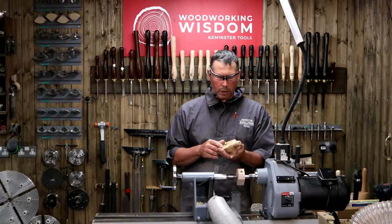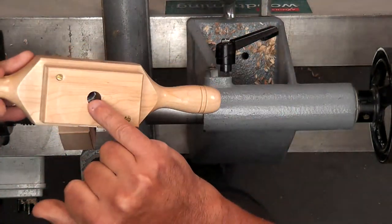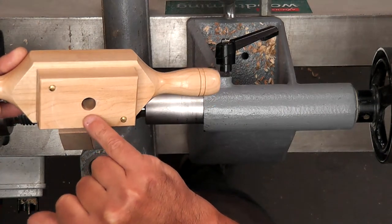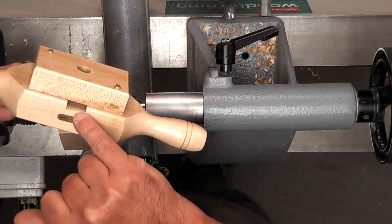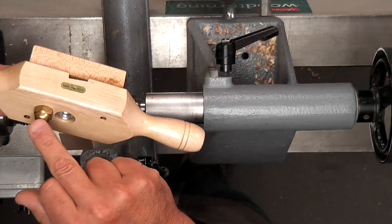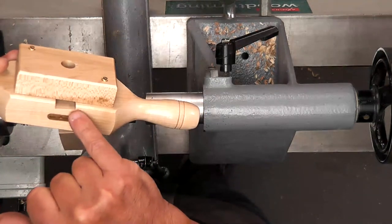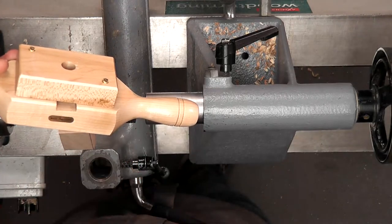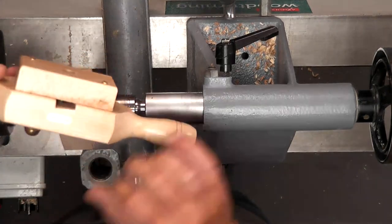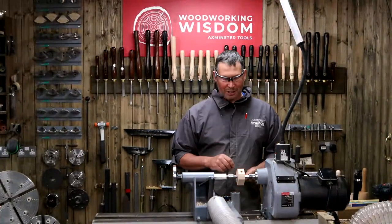And in terms of taking that off, I don't know whether you can see this from above there. So this is your lead in side. This is almost like the register that you run your dowel through, and then it hits the cutter down there. You can just see the port for the shavings to come out here. And then this little bolt at the top is your lock point. So you increase or decrease the pressure on there, and that will allow you then to either pull back or push forward on the actual cutter. You have to do that by accessing from this block as well. So it's trial and error, I'm afraid, Maria. I don't have a solution to get it just right. You just got to keep playing.